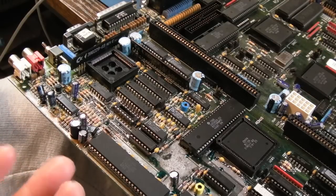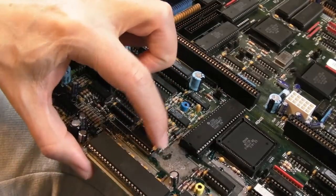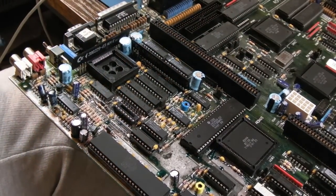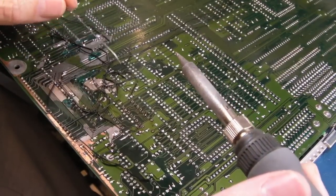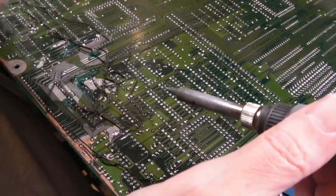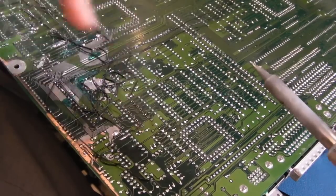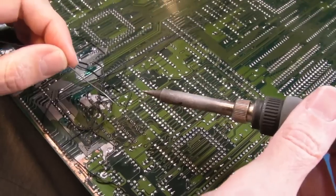And the corrosion is the thing that makes it really hard to get some of the solder points freed up on these boards. I might swap that socket. I don't know. The cap makes a really good connection there, so it's a feature, isn't it? It's an undocumented feature. So it's a horror story under here. Lots of these wires are going to be redone, tidied up, shortened. There's the odd really fine gauge wire here that will be swapped out for something a bit sturdier. It sounded like a good idea using really fine gauge wire for one or two of them, and it is fine when you're fixing a trace, but not from point to point unless it's covered with solder mask paint. Anyway, I'm going to try and see where the socket is now.